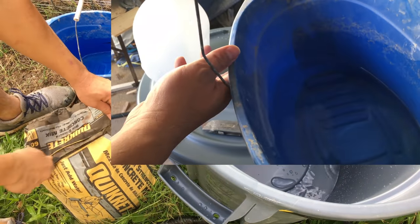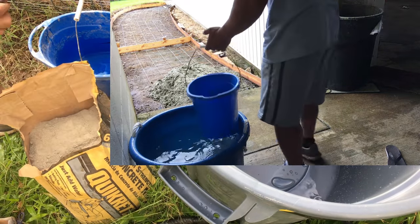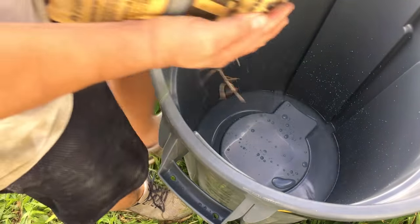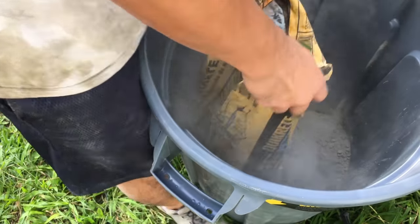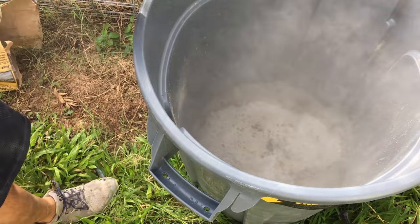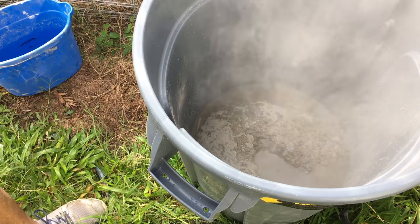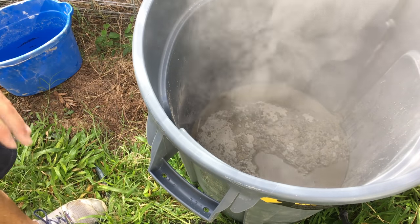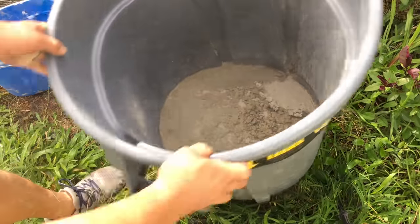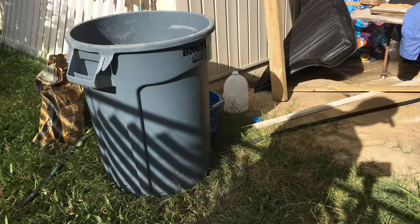To speed up your workflow, mark your measured water level on the bucket with a Sharpie and scoop your water from a large second bucket. Pour in the bag of concrete — it has a pH of 11, so it will irritate and dry your skin after a while. You should wear thick waterproof gloves, a mask, and eye protection. Pour in the rest of the water, then swirl it on the surface to reduce the amount of dust. You could use the lid to encase the dust, but it's cumbersome and will slow down the process.